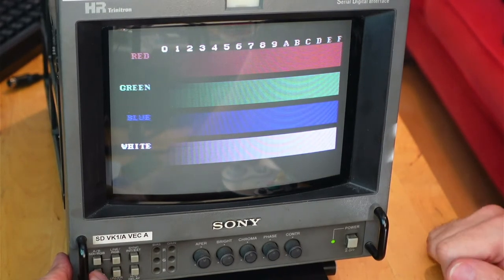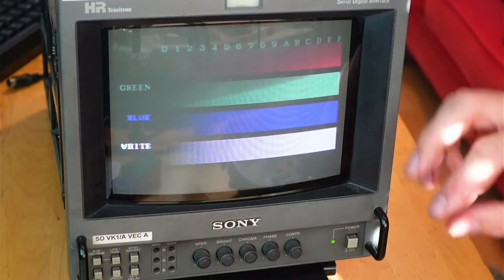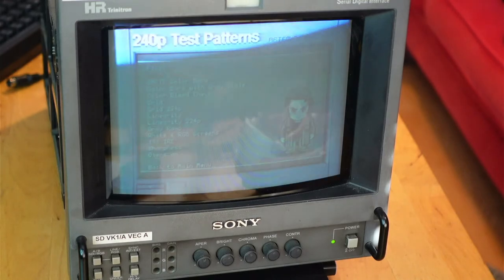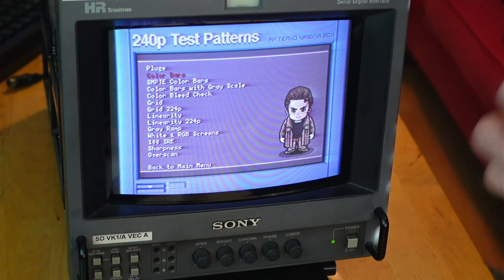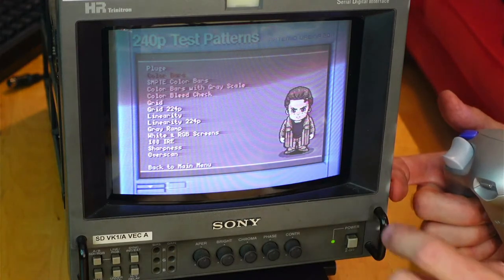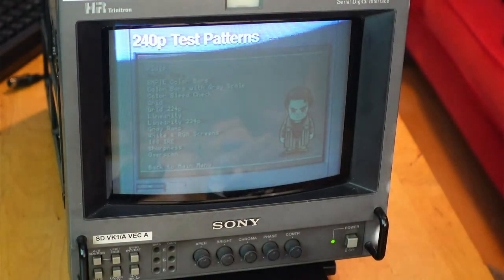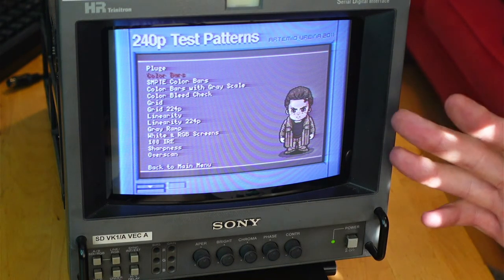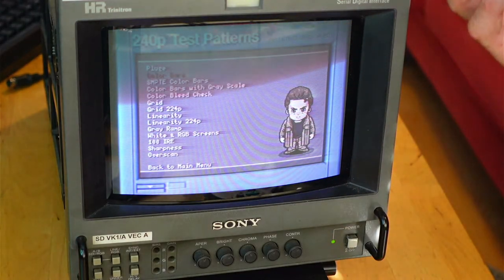Hey, now things are looking better. Wait. Oh, was blue only on? Oh, okay. Wait, hold on. So sorry that the light is coming straight in the window here, but those colors now look very much better. It's still okay, so this tube is still not good. Oh, your tube's fine. No, I think okay, my work to resolder the points has fixed that problem. Now there is color. However, this set in general still has issues. It's still weak, I want to say.